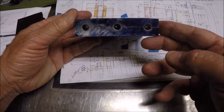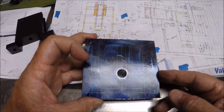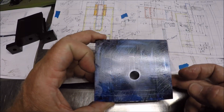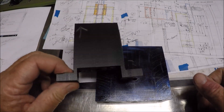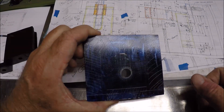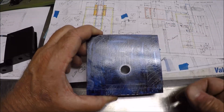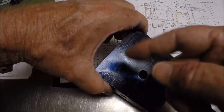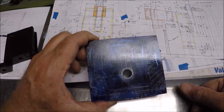I've got the holes drilled and the bottom hole with this radius right here, and now I've got to cut these out. I didn't film the layout — it's been a week and I was trying to remember what numbers I used. Next up is just sawing the pieces out: saw one side, get it cleaned up in the mill, flip it over, saw the other side, put it in the mill and take the center slot out. Nothing too fantastic.